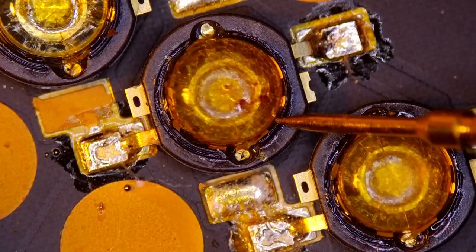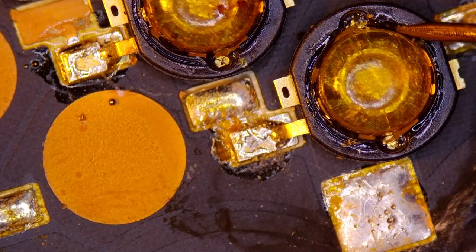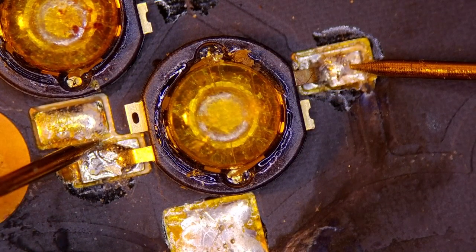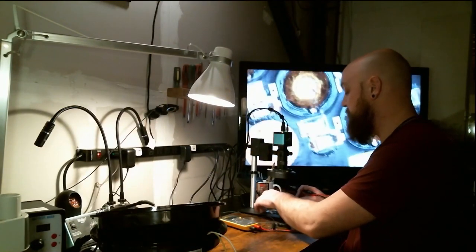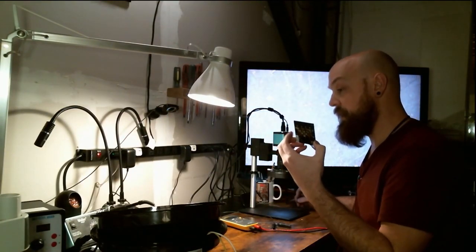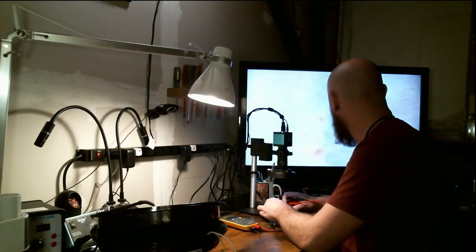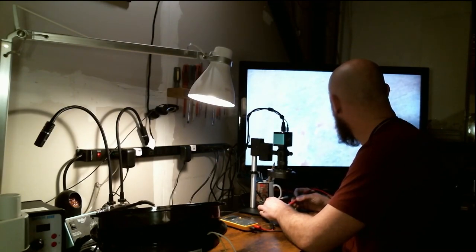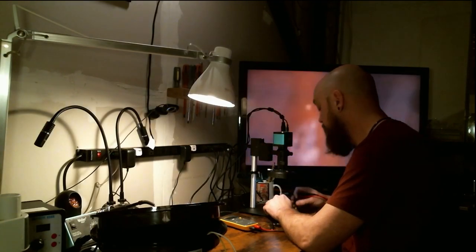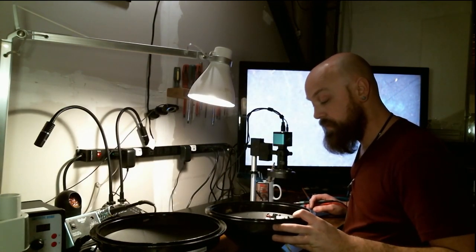See the discoloration — I wonder if that's actually loose on it. I don't think that's supposed to do that. There's like a gel seal on it. Let's just test this last one. Nothing. I am confident to say that this specific board is blown. I'm not going to test the power supply at this point because it won't really matter. I did notice there's some discoloration in this area — it's possible this was struck by lightning or had a power surge or something. Let's move on to the next one to see if maybe that one is good.